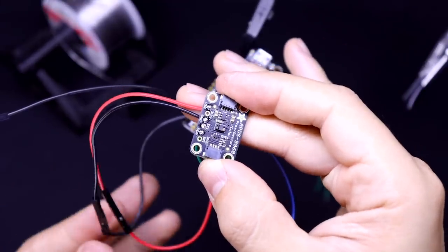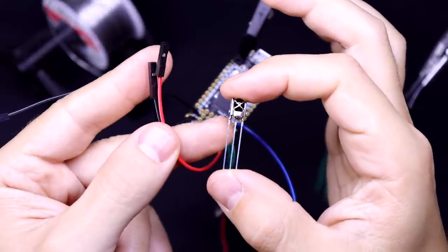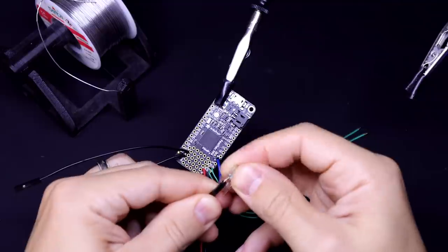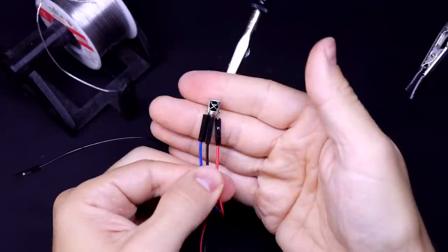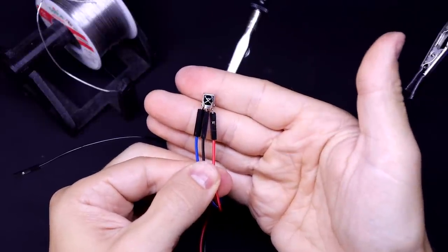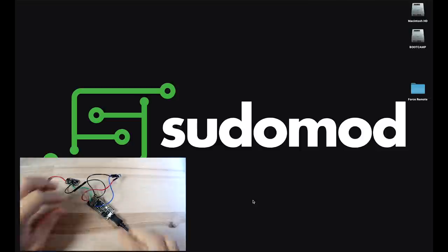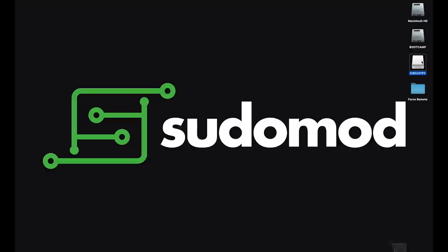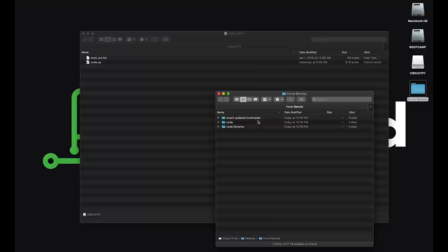So that's how you wire up the gesture sensor, but first we're going to connect the infrared receiver to get our remote codes. Trim the legs down a little bit, and then attach our blue wire to the left one, ground to the middle, and power to the right leg. So at this point you can plug the feather board into your computer — it should show up as an external drive that you can go into and add and remove files from. But first we're going to update it to make sure that it's running the correct version of CircuitPython.